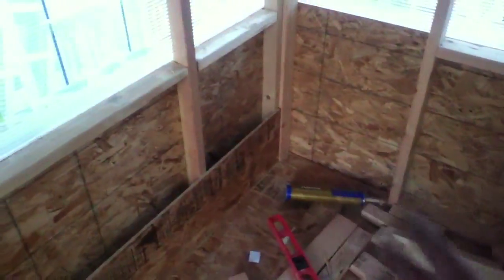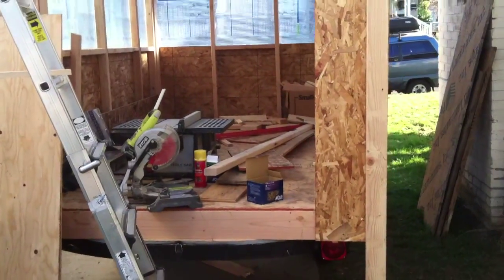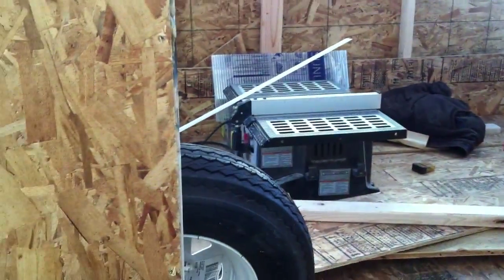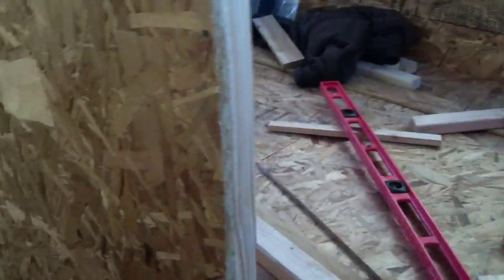As far as strength goes, this wall is made to never go anywhere once it's attached — it's done. Here is a door detail for the rear doors, now for storage and transport. What I'm doing is setting this up with a doorway that's going to get temporarily installed here, but I'm probably going to close it off — just put a board across to close it off. This is the wall that basically gets removed upon arrival, so I'm not going to go through the trouble of cutting anything perfectly to fit. I'll just slap something right over these gaps, screw it on, and that's that.